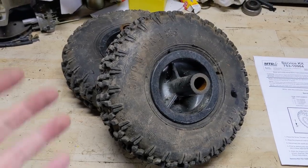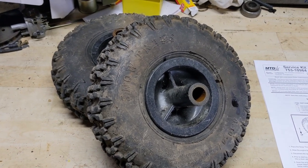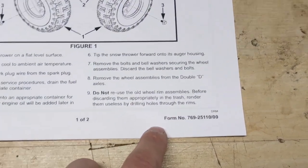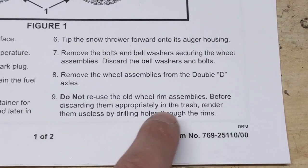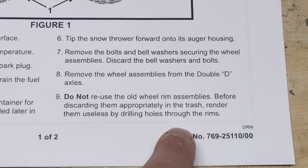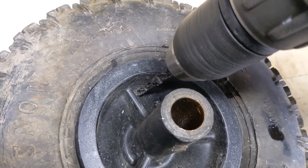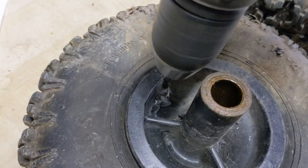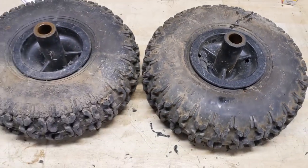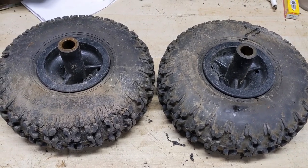You don't want to just take these old wheels and throw them into the garbage, because somebody could find them, think they're useful, try to put air in them, and they could explode and hurt somebody. As part of this recall, the last step says: do not reuse the old wheel rim assembly. Before discarding them appropriately in the trash, render them useless by drilling holes through the plastic rims. I would recommend you take the air out of the wheel first and then drill your hole. So we got a couple holes in each wheel — nobody's going to be using those. We can now dispose of them properly and wrap up this recall for these plastic MTD snowblower wheels.